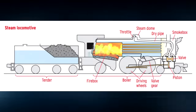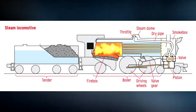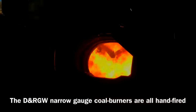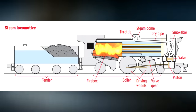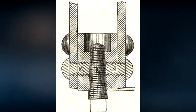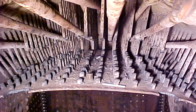At the same time, the quick change in pitch launches all the water to the front of the boiler, fully exposing the firebox to the intense heat. The firebox then starts heating up quickly, evaporating any leftover water residue in seconds. After about 15 seconds, the crown sheet and firebox start to weaken as the temperature levels rise to a dangerous amount. Plugs in the crown sheet then start melting away from the sheer heat, however due to some unknown reason they fail to release the crown sheet from the rest of the boiler, locking it in place.